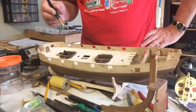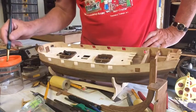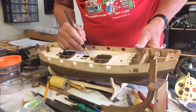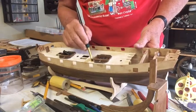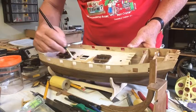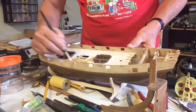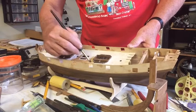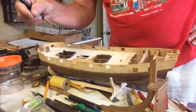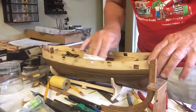And now we are going to put the first coat of polyurethane on it. I've left the dust in because I want to actually use the dust to fill in some of the holes. And we're going to do a few sandings. So right now we're just putting it on. We'll rub it on in a little while with a piece of cloth, but literally using all the dust to fill all the little holes from the boards that somehow didn't stay very tight together. And now we're just going to rub it down,